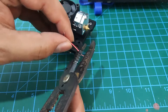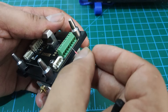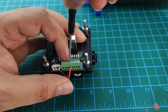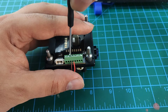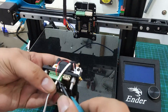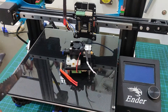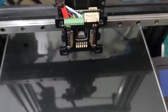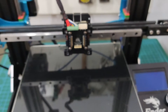After carefully sizing the wires you can cut them to length and strip the ends with a wire stripper. The connections are very easy as everything is labeled. Same process for the thermistor and heater wiring. You may have noticed the cooling fan is missing — I am going to add that later. After wiring the tool plate, just repeat the same process with the fixed plate, then take some time to verify everything.